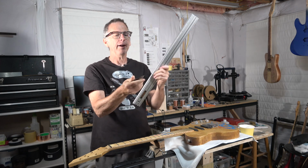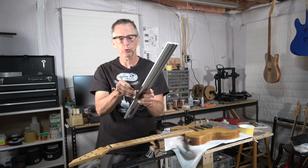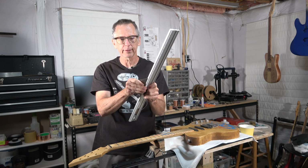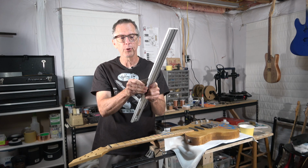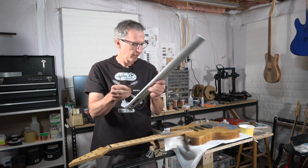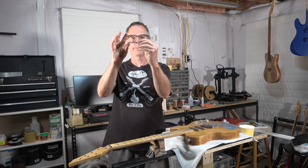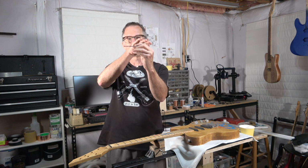However, if I take the sharp edge of the tool and place it so that the tool is at an angle to that precision ground surface, you probably can't hear this. I can actually feel it. It is not straight. It has got a slight bow to it, and it's only in one direction. So, in essence, it's bowing like this. So this side here, the bottom here, is actually curved up. Well, the top is curved up as well.